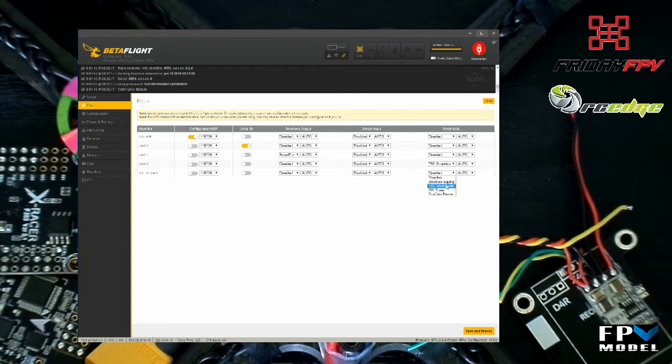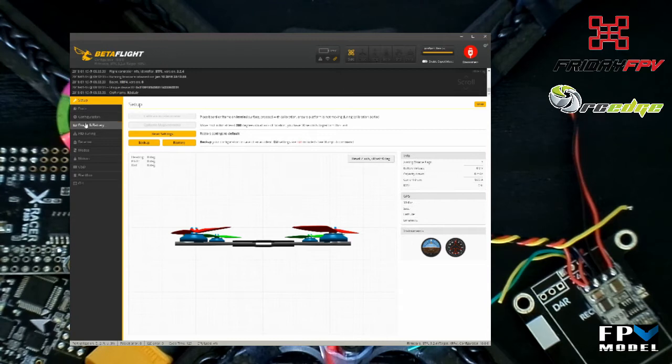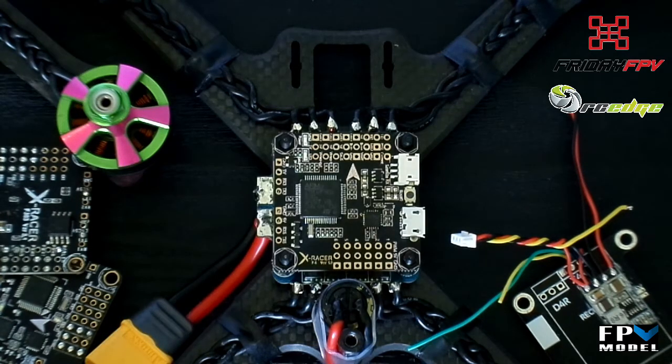Don't forget, if using one of the first RX8Rs you'll need to update the firmware if you want to use Lua scripts. Last thing left to do is connect the current sensor so that your OSD can display current being used. On the BL-Heli S Kamikaze board there is a current sensor built in with an output on the connector — if you're using the 8-pin to 8-pin connector it's already plug-and-play, otherwise you'll need to solder the current wire to this pad on the X-Racer F4. Under the configurator in the power tab, select onboard ADC — it's that simple. Different ESCs and PDBs may require different values so you may need to calibrate your flight controller, using the method where you take the milliamps drawn versus what the charger puts back in. I would do it on an average over five batteries; it's a lot safer than trying to connect a multimeter on an armed quad.